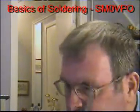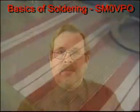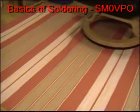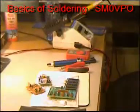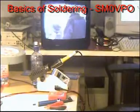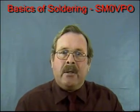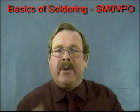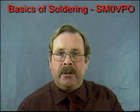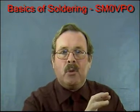The problem is that just combing your hair can generate several hundred volts. If you have a nylon carpet, silk tie and a colour TV set in the same room, then tens of thousands of volts are readily available. And if you touch the TV screen with your hand, perhaps 40,000 volts is possible. When two insulated items have friction between them, there will be a static charge generated — dragging electrons from one surface and moving them to another.